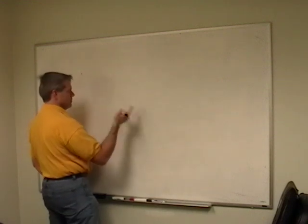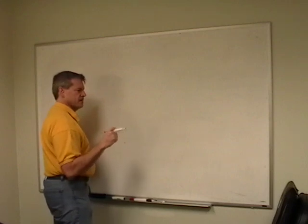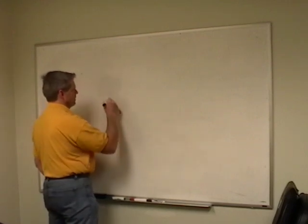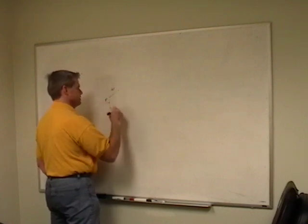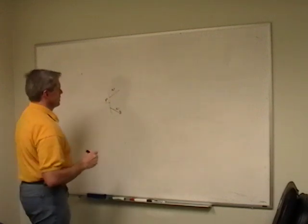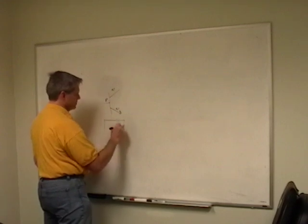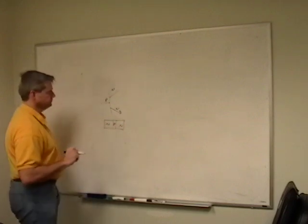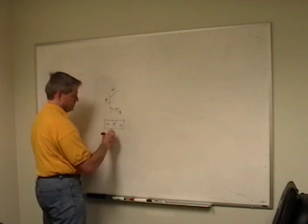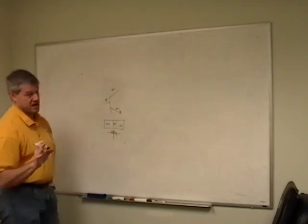So let's go back to where I was going before. Wouldn't it be nice to be able to have something that comes on and comes off and gives you some gain? We'll call this thing a transistor. In this particular case, I like NPNs because they're easier for me to deal with in my head. And what we have is, depending on how you see it drawn, an N and a P area. If you look at this, you say, well, that's really kind of two diodes strapped back to back like that with a takeoff there, which is not quite the truth.